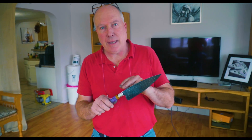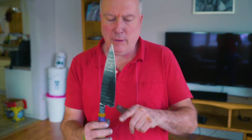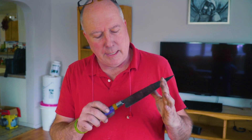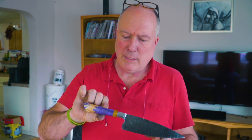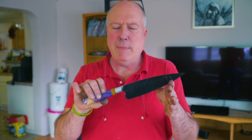I just got this knife sanded to a 1000 grit finish on the bolster. I started sanding and took it to 1000 grit across the spine and across the back at the heel — it came out great. Got it sharpened, it is ready to be shipped. One of the challenges was the classic dad syndrome: I had a finished blade and got a small scuff in it. Had to fix it — sanded it out and re-etched. The coffee etch is probably our best yet, lots of contrast, love it. The handle really rocks with the vintage micarta and the copper spacer and the 1000 grit finish bolster. The heel height gives it a sleek design. This knife will be up for sale on the website shortly. I like the design and I'm going to build some more like it. Got a request for a paring knife after selling that black-handled one, so I may get into that pretty quick.